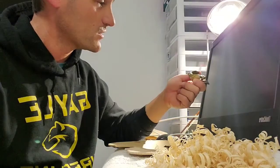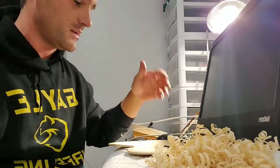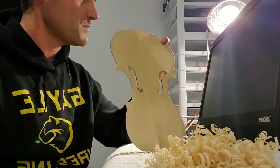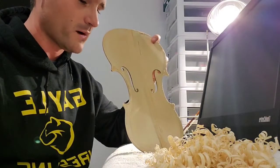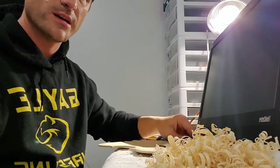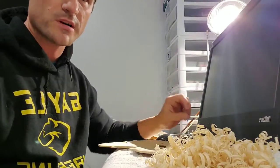I have a few smaller ones that we'll use for smaller details. We'll pick back up next week where I'll have my thickness gauges and go around, map out exactly how thick I want each part, and then we'll start back with these finger planes to hog away the extra material to get it exactly where I want it to be.